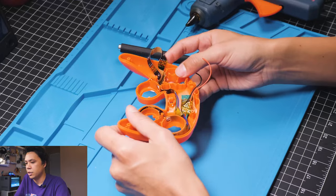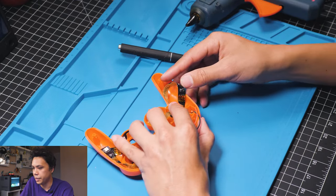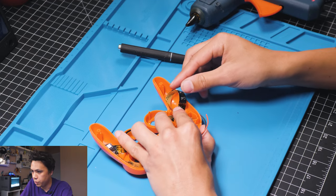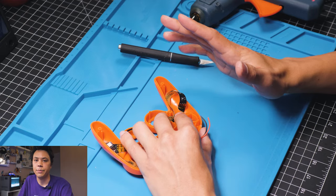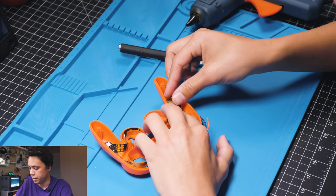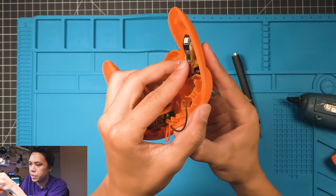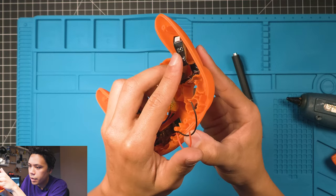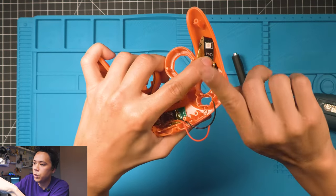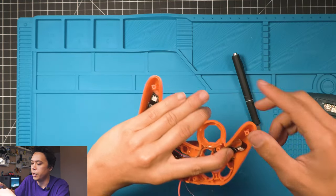All right, good. So next thing we're gonna do is fold this LED down. You gotta fold it a certain way, and this is the other reason that we tape off the contacts, because if the contacts start folding on each other and touching, it can mess it up too. So fold that down. See how I'm creasing it right here? It's gonna get creased right here, and that allows this to show up and then it'll shine through underneath. Same thing we did over here.